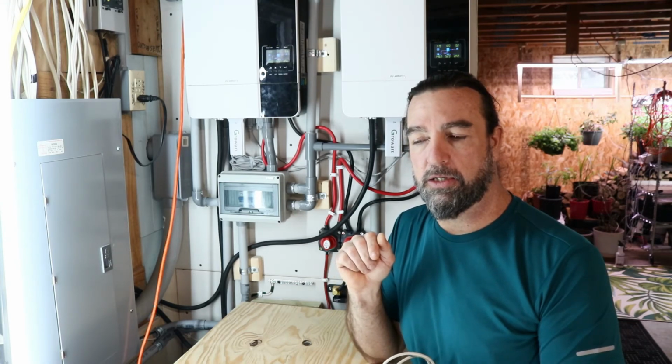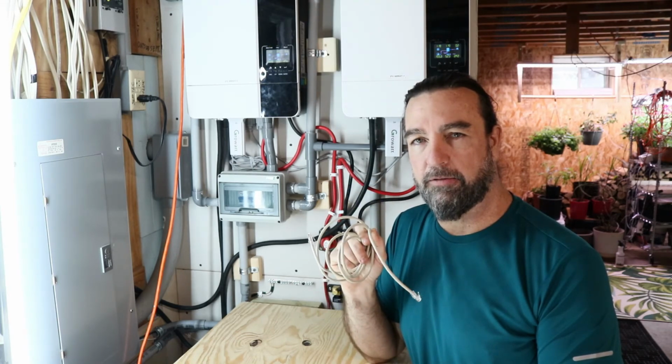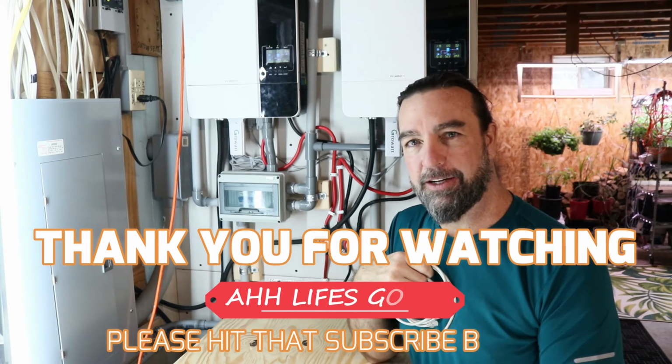It was giving me error code 4 and the batteries were actually at 50%, so that error was also incorrect. And then of course I got error 20, which is the BMS communication error. So the question I had was, will the crossover cable work from pins 1 and 2 to 7 and 8? As the manuals say, no it doesn't, so we've eliminated that question.